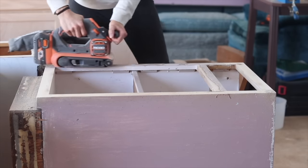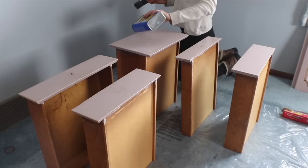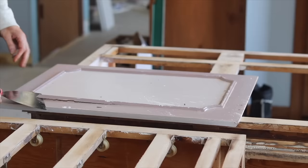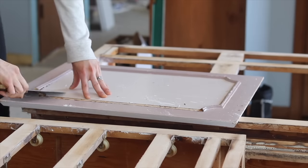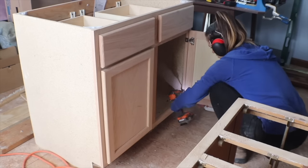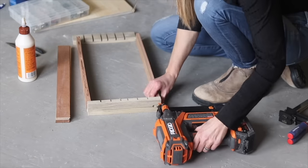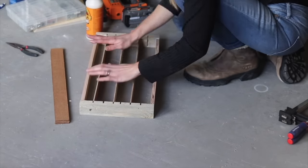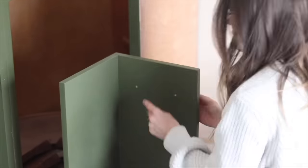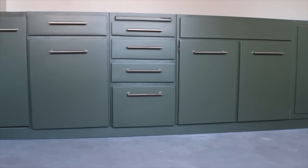Next I painted the walls and continued refinishing the lower cabinets. This took me three weeks — so much work — but the old paint job was terrible and I didn't like the trim detail, so I removed all of it and sanded all the fronts down to get a really smooth finish. I rearranged the cabinets I had, added one prefabricated 36-inch cabinet that I modified to match the rest, and built a custom pan rack at the end of the run where I had a weird space left over. The cabinet hardware was sponsored by Bellwith Keeler — it's called the facet pull — and it truly made this kitchen look like a million bucks.